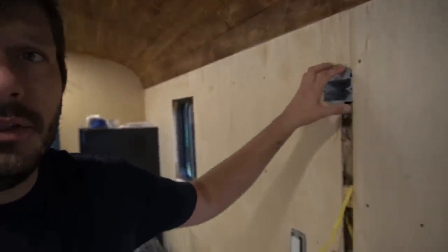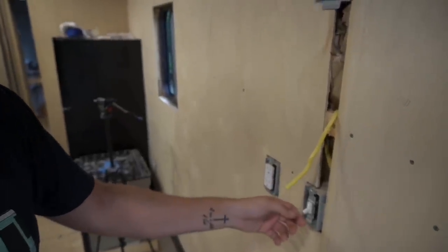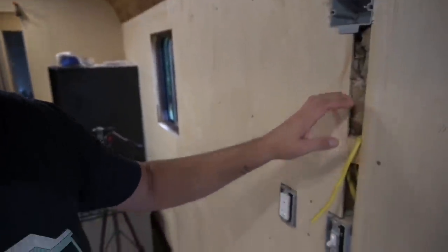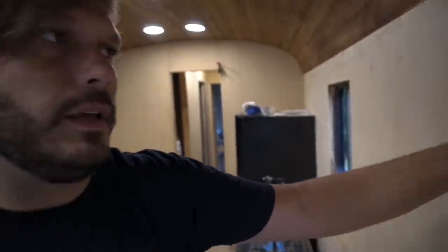But today I'm gonna work on getting these lamp lights raised up a little bit higher in the wall. When we wired everything, we put them about right here in the wall with the switch directly under it. But I realized that that was gonna be just a little bit too far down. I've gotta cut a hole into the wall, which is totally fine. All this is gonna be covered up with shiplap. Put a box up here and wire everything. And I may go ahead and install those lights just to get them up and see how they're gonna look.